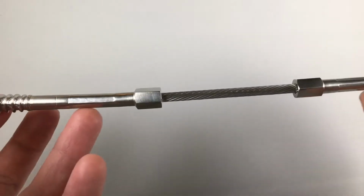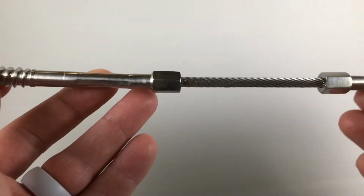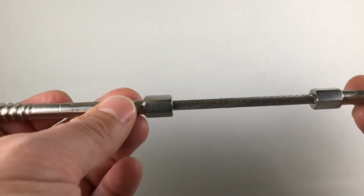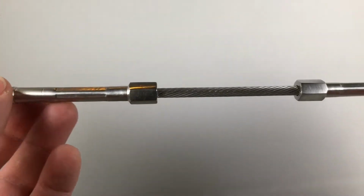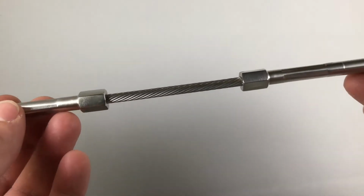As you can see, it offers well over 2 inches of tensioning here, and on both sides, so a total of 4 inches of tensioning, which is compatible and right up there with our turnbuckles, but offers a much more streamlined look. For these to work where you can really bury them all the way, you're gonna want to use a 6x6 post, so they work perfect with 6x6 and up.